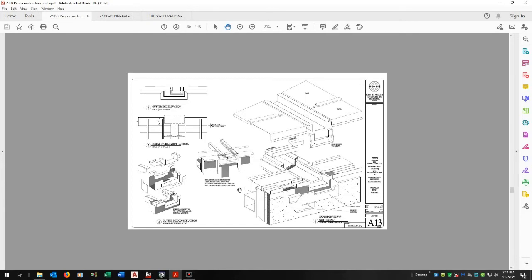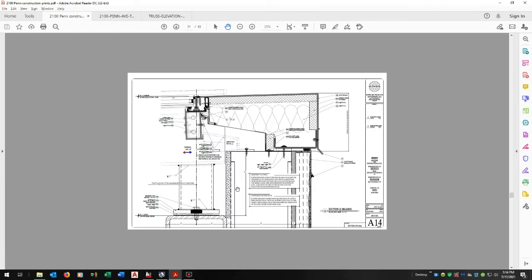Take some time, look at it — it is complicated but hopefully not too bad for you guys. I think the worst was put in the shop. This is at the east end where the layout of the frame didn't cooperate with what we were doing, so there's a lot of odd assemblies of bar. In general we're doing the same thing with the flashing and just muscling it in where you need to go. There are some welded joints where two bars make an elbow — wherever you see an elbow in a crossbar it needs a little clip tech screwed in and then screwed down. I think they actually turned out to be more of an L shape than a weird Z, so look for the L — it's sitting right above the stud, just screw it down and into the bar. It's just to keep it from rotating.